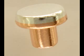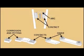Contacts can be constructed to handle extremely large amounts of electric current, up to thousands of amps in some cases. The limiting factors for switch contact current capability are heat generated by the current through the metal contacts while closing, sparking caused when the contacts are opened and closed, and the voltage across the open switch contacts — the potential of current jumping across the gap.